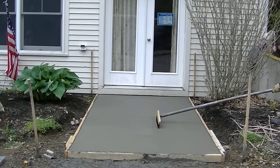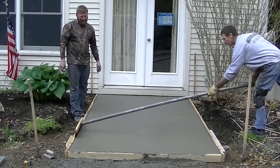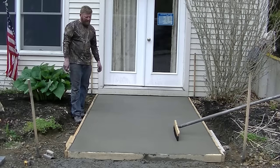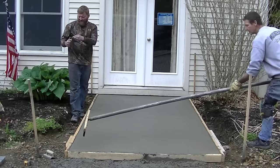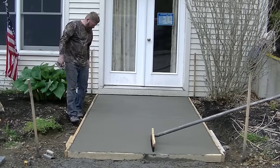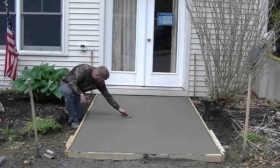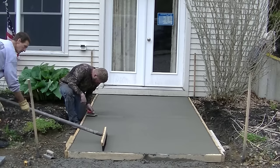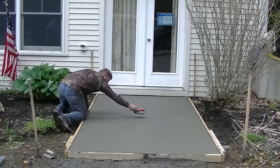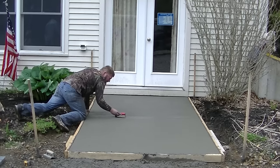So you guys let me know — dry poured versus wet poured concrete. I know there's a ton of videos out there pushing dry pour, but do you really know how strong that's going to be down the road? Do you really know if the concrete is evenly hydrated throughout the thickness of the slab? Did all the cement particles come in contact with water or moisture so they can properly harden? I think you can all admit that with a dry pour you're not creating any type of paste — you're not creating a glue to encircle the aggregate and the sand to create a nice strong mix. There's no glue, you're not making any type of paste.